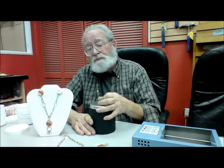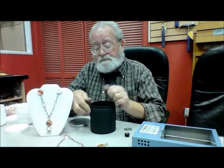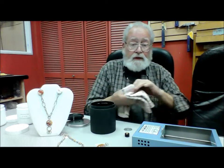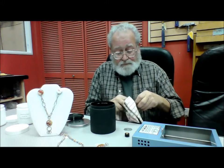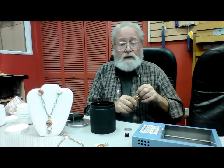When you finish — hopefully two hours — you can take the piece out. Then simply wash the piece off. We've used stainless steel shot for a very good reason: the shot itself will not rust, so you don't have to protect it from that. Polish, wipe the piece off, dry it, and you should have a very fine polished piece.